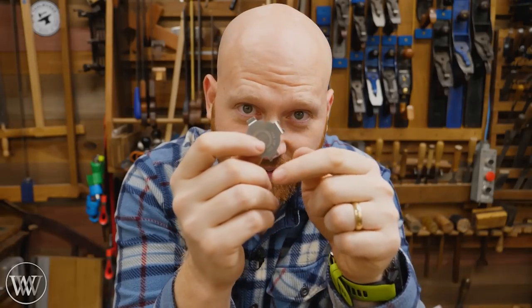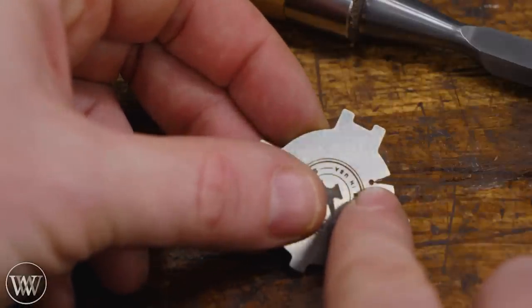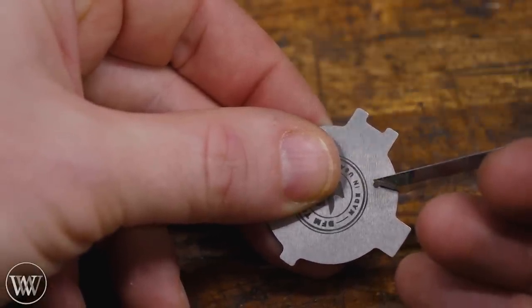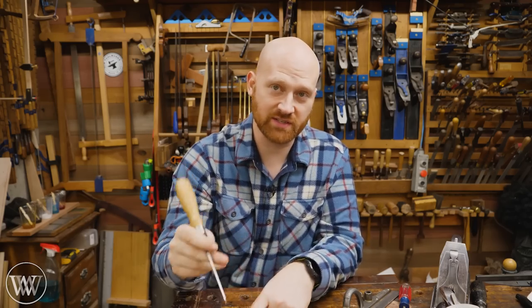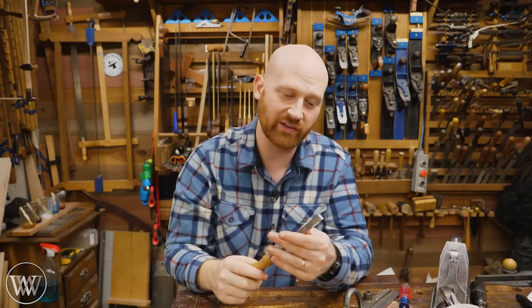There's also a tiny little V-notch on the end of this with a hole at the bottom. This slot is 25 degrees, and it has a little hole so it won't hurt the tip of your chisel or plane iron. So now I can put a blade in there and know that I'm exactly 25 degrees and not hurting the tip. Rex and his woodworking style love simplicity, so he sharpens everything at 25 degrees. I like to sharpen things at other angles — I can eyeball it and say yeah, it's about 25 degrees, or look at my plane irons and say it's about 35 degrees, and that's close enough for me. But if you really want to know the angle, having this on hand makes it really fast to just check it.